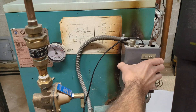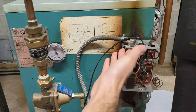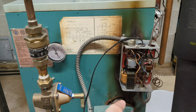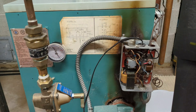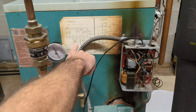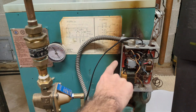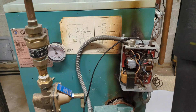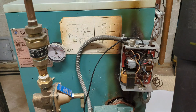This main box is set up with all the controls needed for running one zone with one circulator pump. Those other boxes are extra ones for each extra zone. This one is described in the wiring diagram — again, you've got a transformer, relay, and then the switch for sending that signal over to your burner.